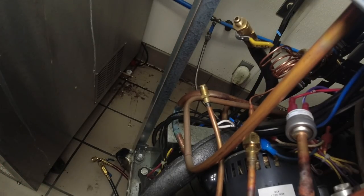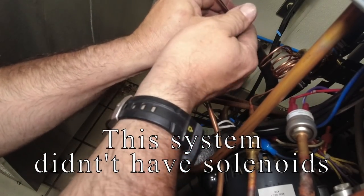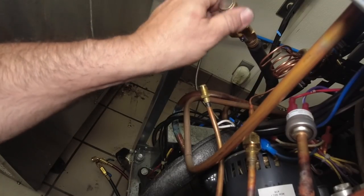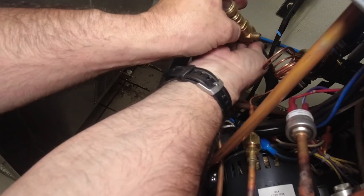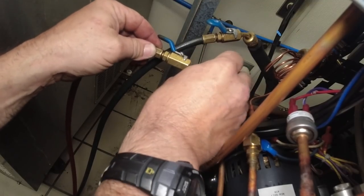Today's one of those days where it's absolutely Monday. The vacuum did level off, stayed solid, locked up, and did not move anymore. It's kind of satisfied now so I'm going to have them start drawing on this. The compressor on the cabinet seems to be working. It might need an ounce or two, which wouldn't surprise me. We put in 36 ounces just as it's spec'd.